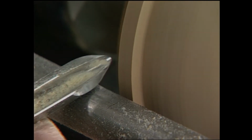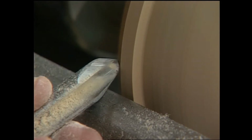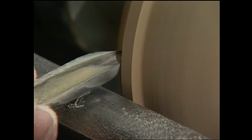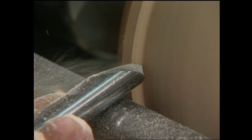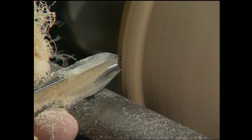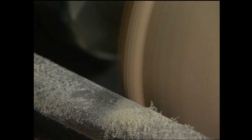Now again, end grain, so I'm not going to turn a bead like I would normally on a spindle. I'm going to do a small pull cut and start shaping the bead this way. I'm going to make that a little bit thinner though. There we go. Now, watch me pull from this direction, just touching the edge of the tool, trying to leave as smooth a surface on there as possible. If I'm lucky, I can start sanding at 220. There we go, that's nice.